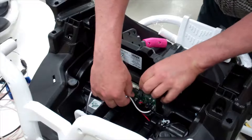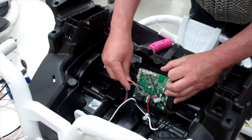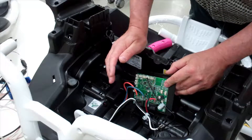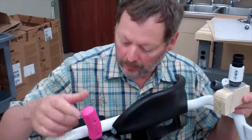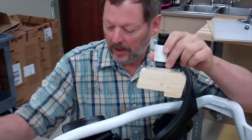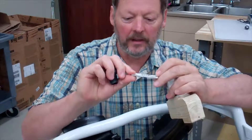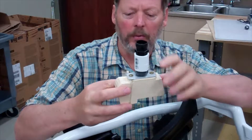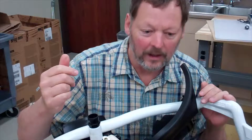This goes to the power plug going to the battery. You can just remove these plugs, but pay attention to what's right and what's left — two control the motors on the right side, and the other two control the other side of the cart. I'm not using the original switches; I'm using these things more as platforms to put my Lockline. I took a 2x4, planed it down, used my band saw and cut it out. I made these little aluminum plates, drilled a hole, tapped them with half-inch MPT threading, and mounted that right on top of the board. That's going to give me a nice starter piece for the Lockline to mount the joystick on.